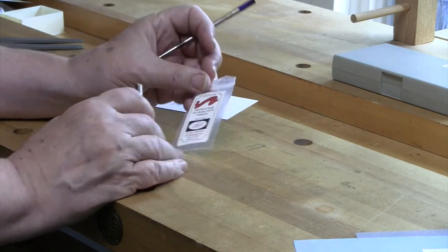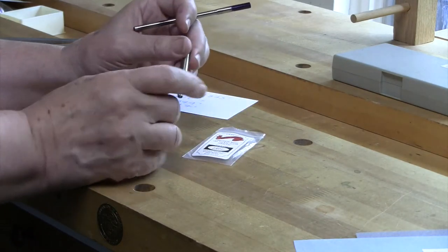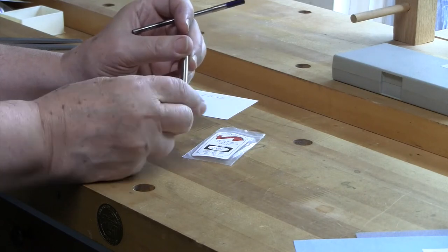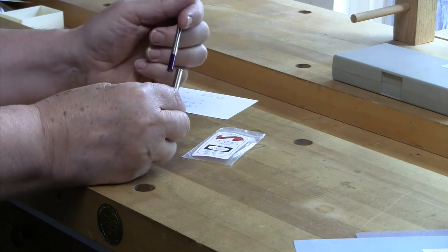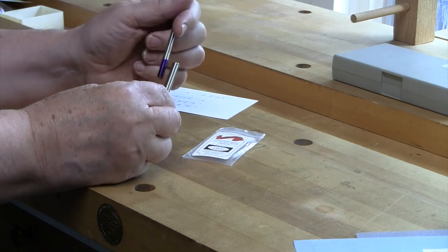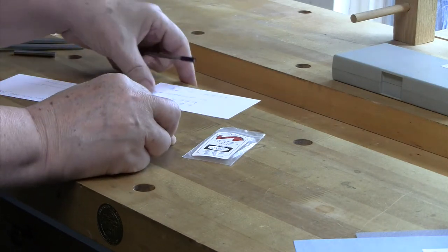This is a size 13 Super Swiss ferrule. And on a 13 Super Swiss, it's 13 at the business end where it meets the bamboo, but it is 15 where the slide goes together. It's always two sizes bigger. So knowing that might just help someone from getting confused. So we have here a size 15 ferrule.